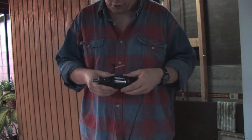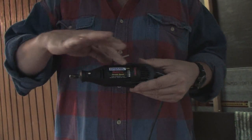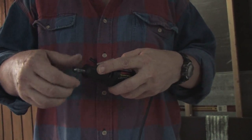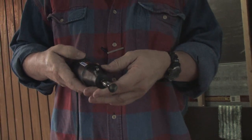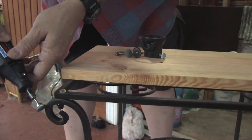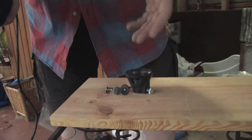In this case, I do have an attachment to show you. This is the basic tool with the basic setup. There's a motor in here and this collet — this is an eighth-inch collet — and this is the spindle lock so you can put on an attachment. In this case, this is a wire brush that you can use for scraping rust off of metal. For example, I'm going to show you on this metal table. So if you were going to want to repaint this and there was some rust flaking on there, you could easily grind it off with the wire brush and prep the surface for paint.